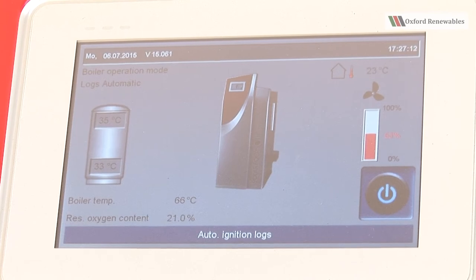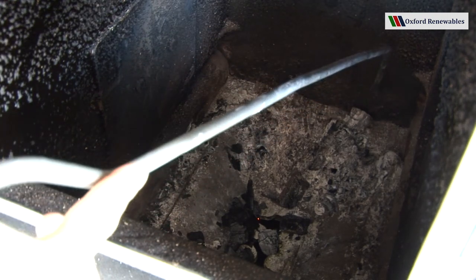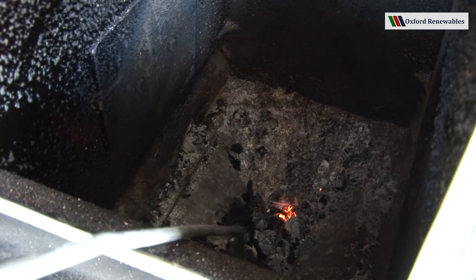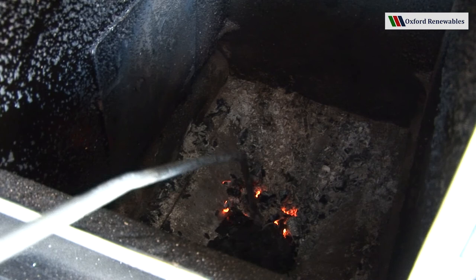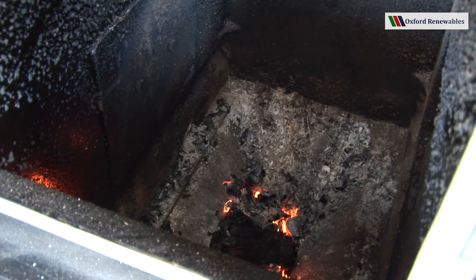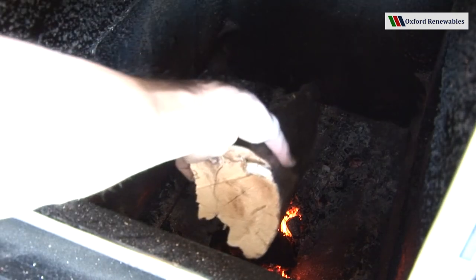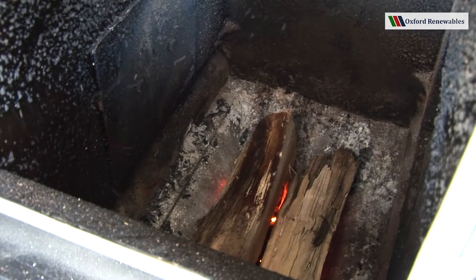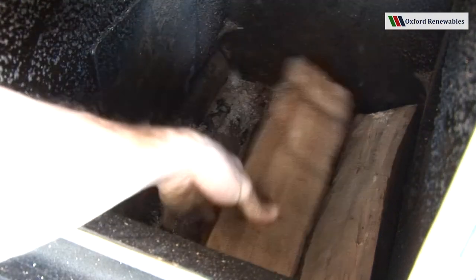As we have recently used the glow holding feature, you'll find inside the ash chamber quite a lot of charcoal. So the trick is just simply to bash this charcoal down and fill up the chamber, or fill the crucible rather, where the grate is lying, with the charcoal embers, like so. And then simply all you need to do is put your logs straight on top. Just use the roughest logs first of all, put them on straight onto that charcoal bed, and literally from there load the chamber all the way to the top,